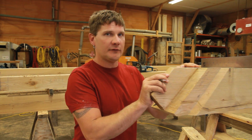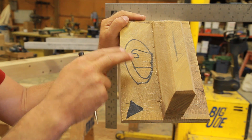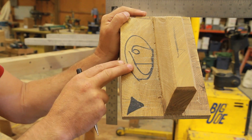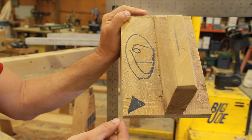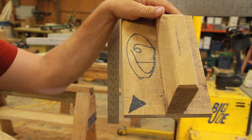It's also been labeled. You can see that it's got the bent number and the location — this is Queen Post 6D. We've also noted the reference corner, which is important because that's the corner or aris point from which all the dimensions for this timber have been taken.